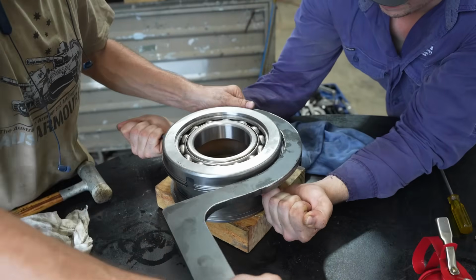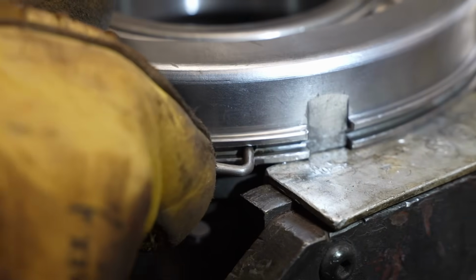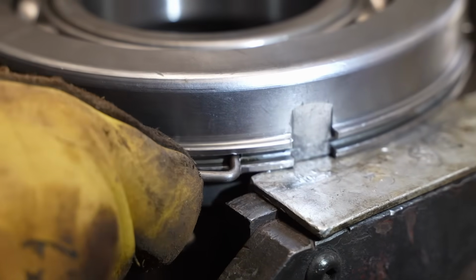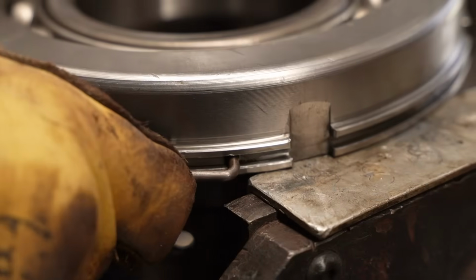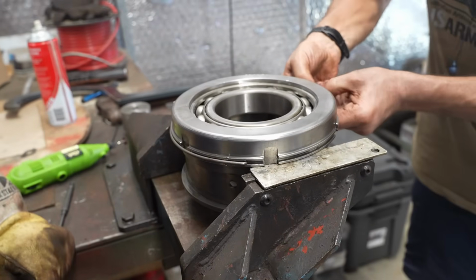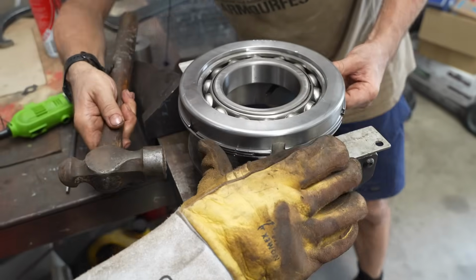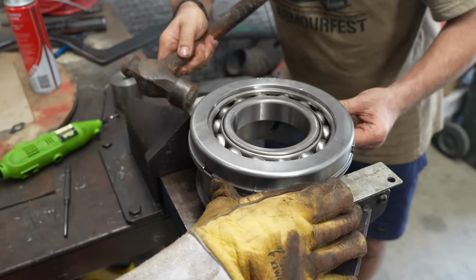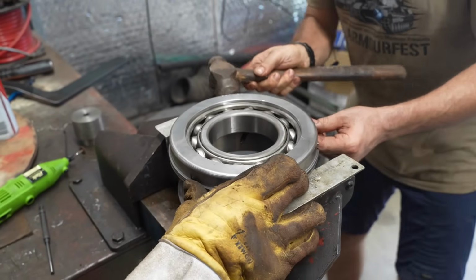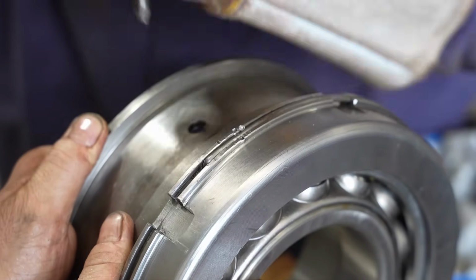Alright, you're almost there. The cap is locked on with a wire that kind of looks like a bucket handle. It pushes through a hole in the cap into a corresponding hole in the sleeve. This also helps us know that we've tightened the cap up enough. To stop the wire coming out, the groove that it's seated in is peened over with a chisel.